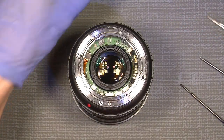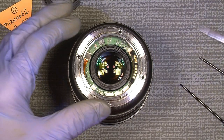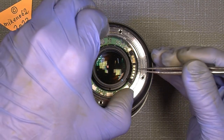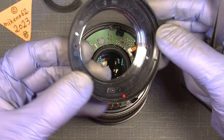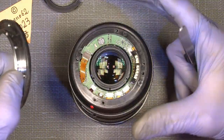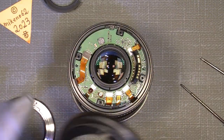Good to have a magnetized screwdriver in some cases, and a straight tweezer is also fine. Now push the contact bridge so it's free, because if you just pull out the mount you could probably break the flex cable. So lift it off, and you can see the whole back here come loose. The mount itself came off — it has to sit so that the red dot is in line with the AF-MF button. We can just take it off, no problem.